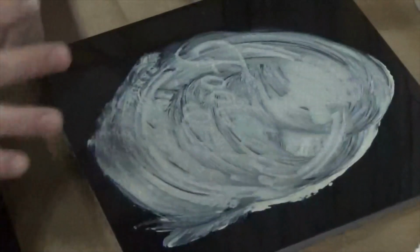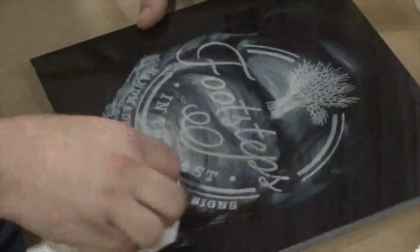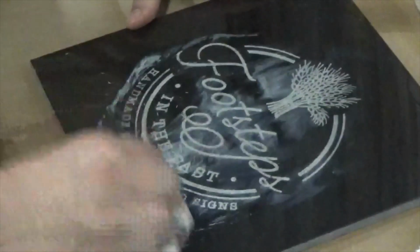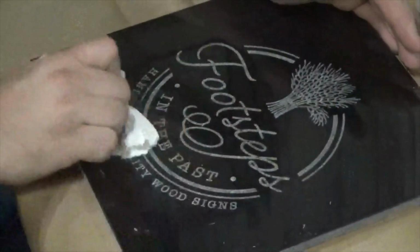We're gonna come back over with a dry rag, just a dry rag. We'll go ahead and start wiping up like this. So I'll show you the cleanup in just a second. Another clean rag. And you'll notice when I was wiping it off there, I was buffing it off. I had a dry rag, not a wet rag, and I buffed it off. It all came off phenomenally. We don't need to use mineral spirits or paint thinner with this process. This process is actually a lot easier